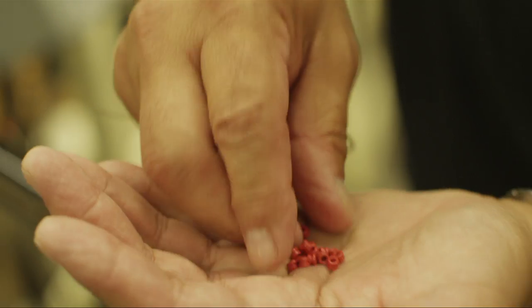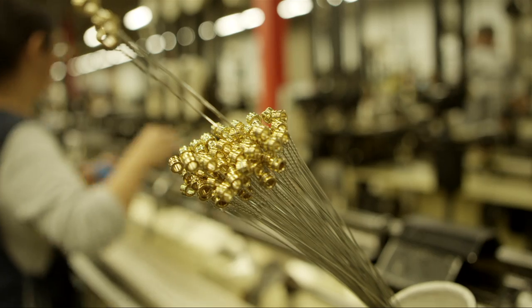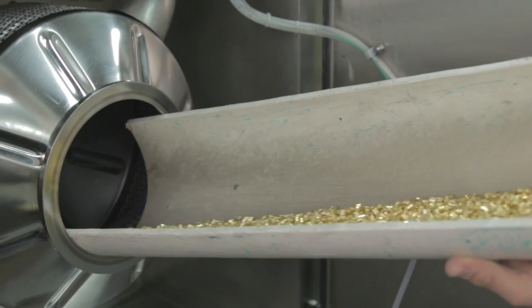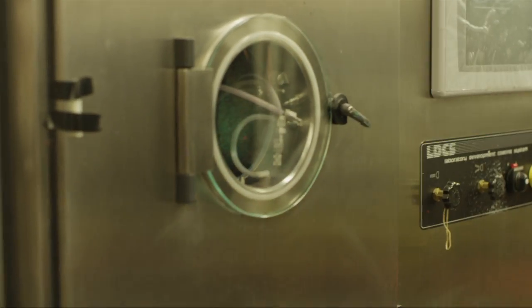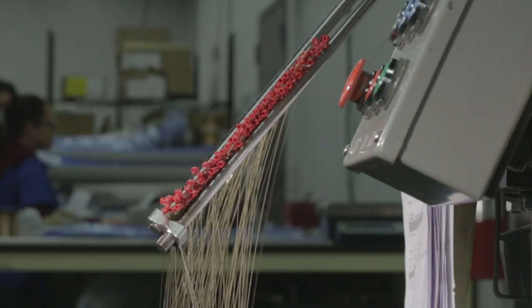Sustainability is very important to us. By using color-coded ball ends, we were able to eliminate individual paper envelopes that our competitors still use to identify each individual string in their sets. Even our color-coding process for the ball ends is an environmentally friendly, water-based formula that we apply just before twisting them on to the plain steel and hexagonally shaped core wires. We actually developed a process where we color them ourselves to control the environmental waste.